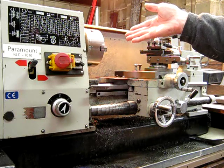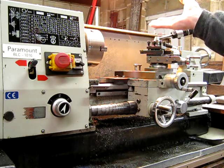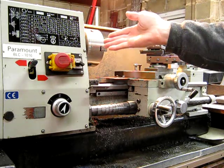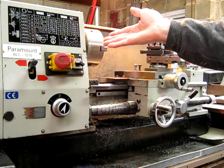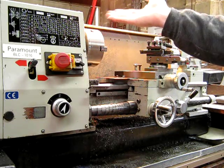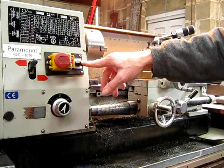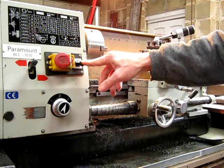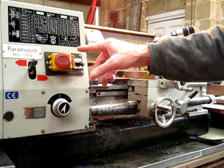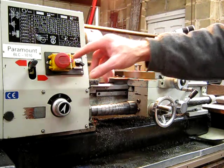Spindle size isn't a deal breaker because most of the time you won't be feeding through the spindle. But for some jobs — gunsmithing, things like that — it's very important. The actual bearings on the spindle: roller bearings are obviously a lot more heavy duty than ball, so if you're doing heavy work, roller bearings are definitely the way to go. But for smaller size lathes, ball racers are quite okay — it's all adjustable for any wear, so it's no big deal. All the lathes have motor reversal so you can drive the chuck back or forwards, which can be handy. They all also have a safety cutout switch: the power goes off, the unit shuts down, the switch deactivates, and it won't start up when the power comes back on until it's been reset.